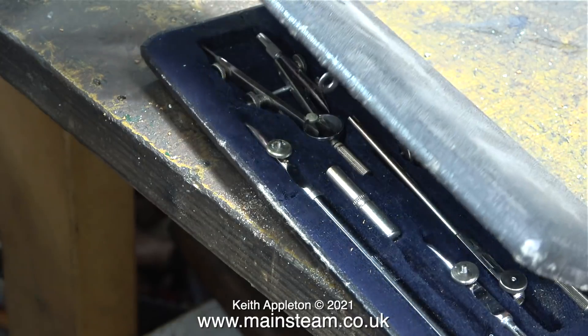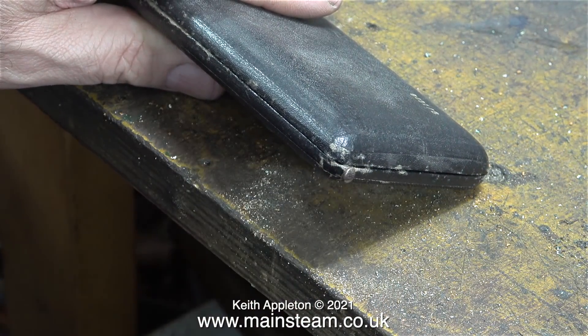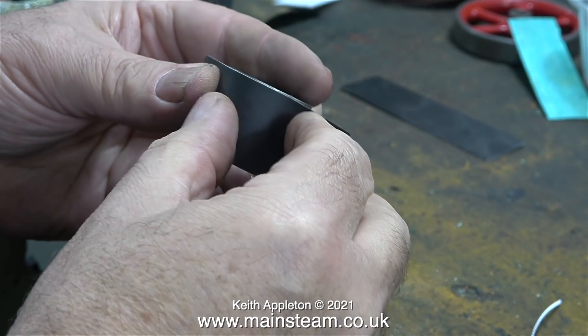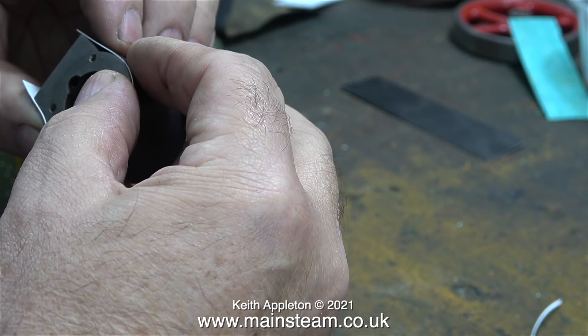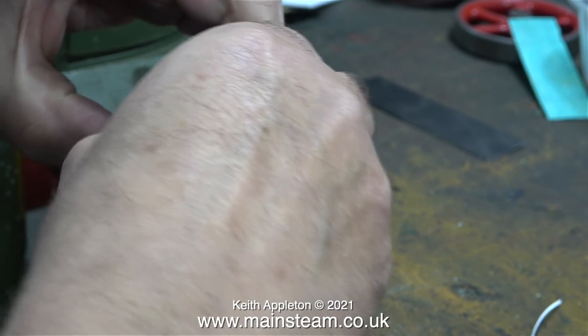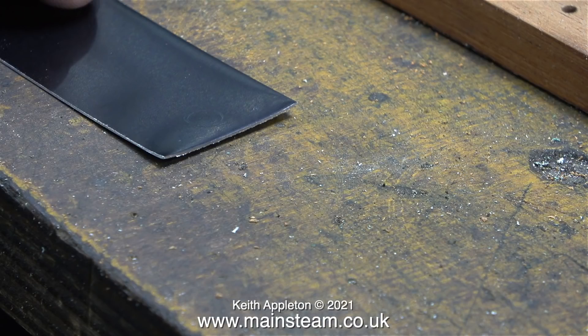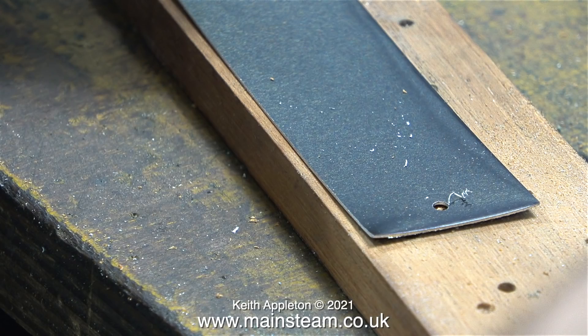Keeping the bench tidy, I'm putting away my really nice old set of drawing instruments. I found some good-quality card — it came with my car and I've been using it in recent years for holding transfers. Using this card I made the template that I needed. This one template should be okay for both cylinders, but just in case I cut another piece. I created holes in the card template where needed, then cut the piece of aluminium using my old pair of scissors. Cutting the aluminium does distort it slightly, but that's an easy fix — you just put it face down on a piece of clean wood and gently tap it with a hide-faced hammer on the reverse side.